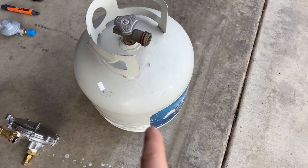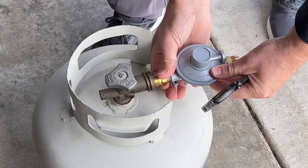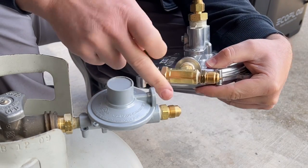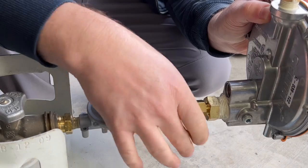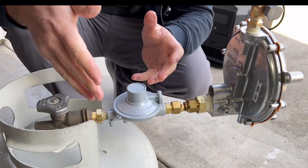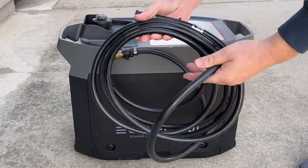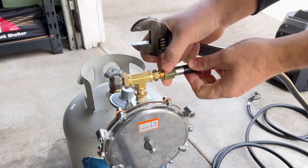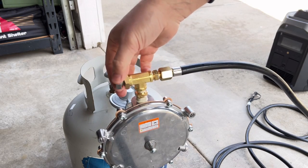When using a propane bottle, use one that's been cycled two or three times — not brand new, as that will create problems. Hook up the regulator — it has reverse thread so pay attention. I added a three-eighths flare on both sides plus a double three-eighths female connector so this whole piece can connect together off the generator. This is an extension hose like you'd see on a barbecue, with a quick connect on one end and a three-eighths female flare on the other — about 15 feet long.